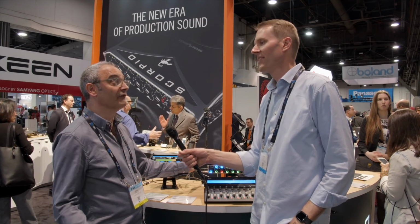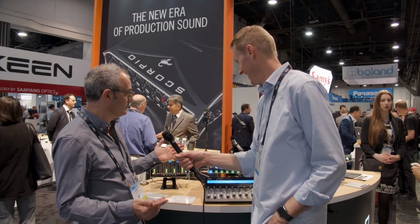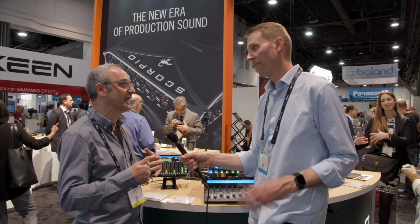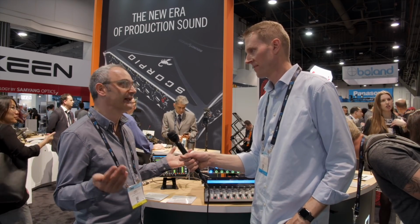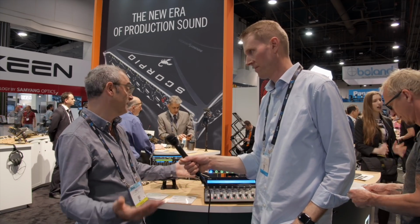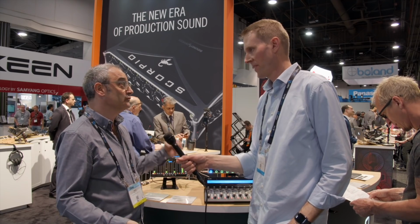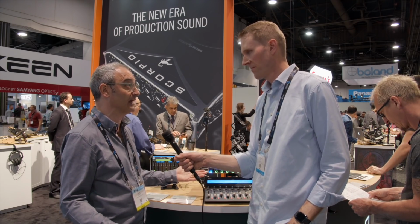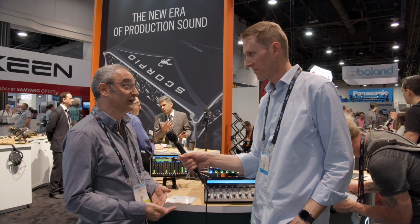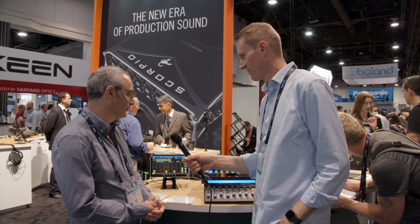Dante. Don't know if I mentioned Dante. Not yet. Okay, so we feel that Dante is definitely the digital future. And you walk around NAB now, virtually every console, virtually every mic interface is all Dante now. So it's very important to us that we can fit and work in that network. So we can pull in 32 channels over a network, super low latency, all that to 192K. You can even use Dante as an interface to your computer instead of a USB audio interface. Right, okay. So there's lots of things you can do there.